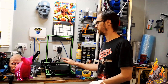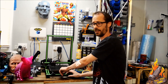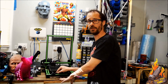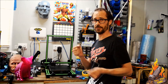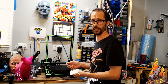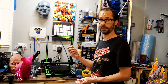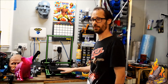Maintenance for this machine — very little really. Belt tension from the front here on the Y-axis, and for your X-axis, just undo these bolts and slide it across. The downside is they've given us non-reinforced belts, just the rubber stretchy kind. So over time they're going to actually stretch out, and there's only so much you can tighten a belt before it's too loose and you'll have to actually cut it and rejoin it. I would suggest getting some good GT2 reinforced belts with the fabric inside, because they don't stretch.